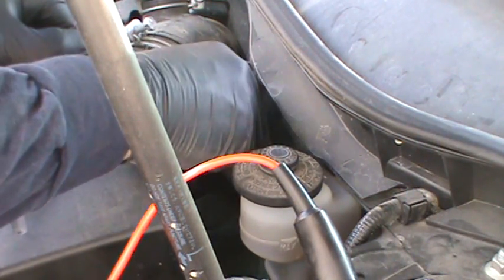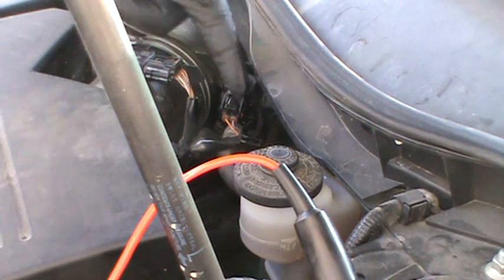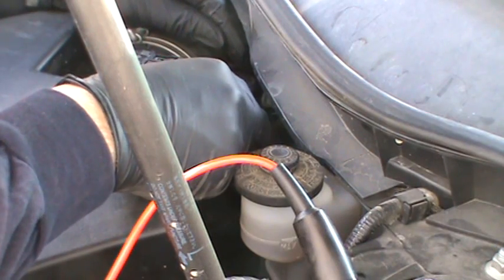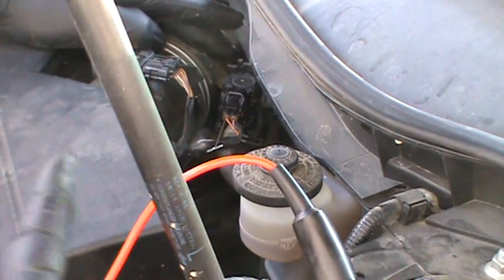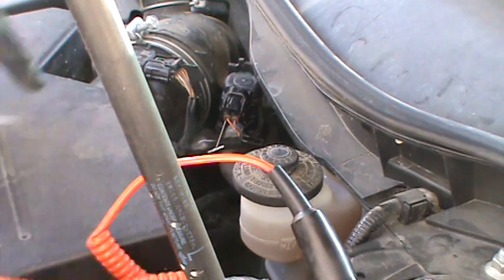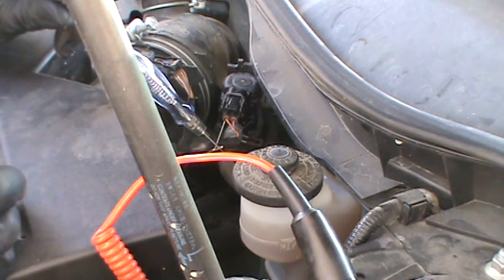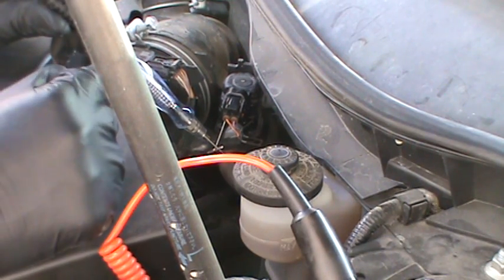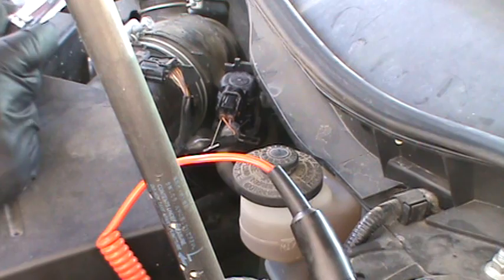What I'm doing right now is I just want to see a little bit of flow of electricity. I know the one on the right side is the power from the fuse — the fuse supplies that because I got the key on. I'm going to get in here and back probe it — this is called back probing. You want to make sure you're nice in there, you don't want to go crooked or sideways. I still have the alligator clip hooked up to a known good ground, and I'm just going to touch this. You see it lights. So right there, there's not a lot of amperage flow — this is milliamps — but there is flow through it, telling me it's at least not broken. At least the internals of this thing aren't broken.